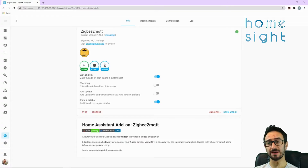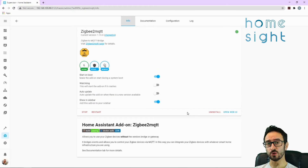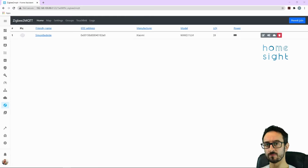Let's start adding them into Home Assistant. We're going to be using the Zigbee2MQTT add-in. I've got mine running and configured already — I'm using the CC2531, which appears on the serial port. I'm going to do another video on how to set this up in the first instance. All you need is to have it set up and open the web GUI. One of the most recent changes — version 1.15.0 I think — brought in a much better web UI which allows you to show it in the sidebar.